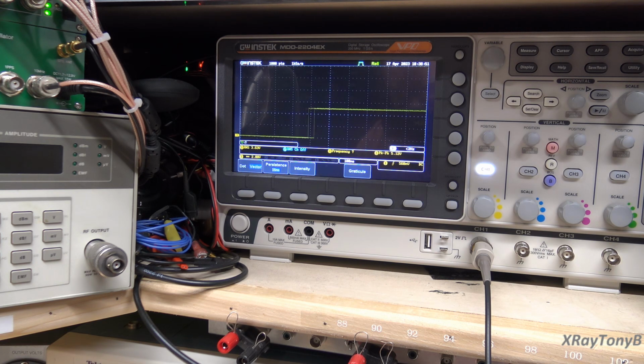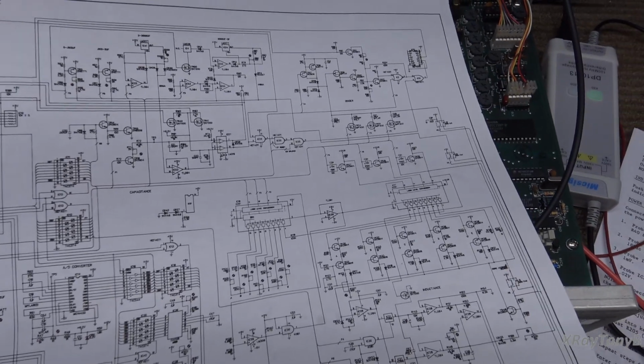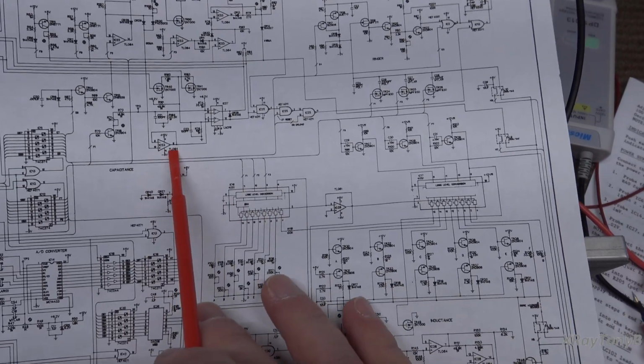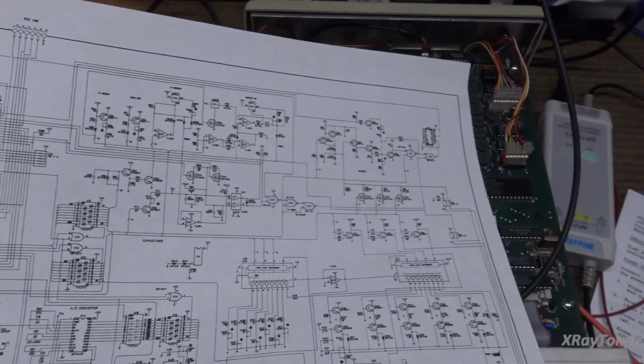How about pin 4, which is the output, and it's constantly high because it's a NAND gate. So that tells me we're not getting anything out of the LM319. So let's go back to the LM319. Sorry, I'm thinking out loud and I might not be describing things correctly, but we were able to see something here. And the camera is drifting.